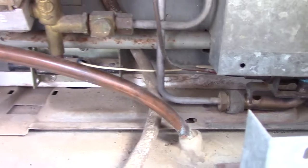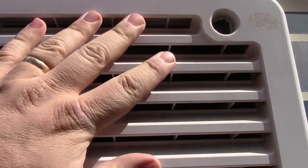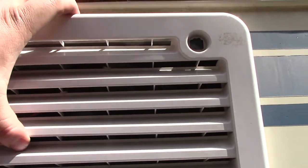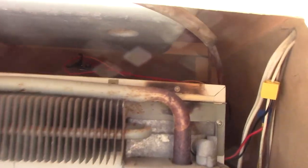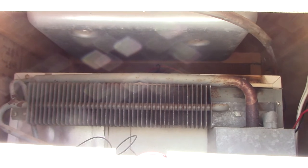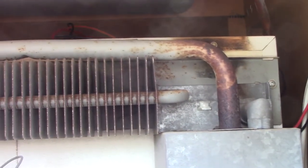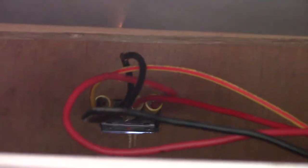You want to make sure that's all nice and clean — keep it clean in there and put the fans on it. I think the fans make a huge difference because it gets very hot up in here, and the fans help bring that heat out — you can feel it coming out of the top right now. Definitely put fans on it. You can even put them on a thermostat and mount it up where it's really warm so it'll kick on automatically when it gets hot — that would be ideal. For right now I'm just using the switch on the front of the fridge. You also want to keep those coils clean — blow them out, try not to hit them too much, but make sure all the dust is off them. There's where I mounted the switch to the inside of the trailer — I just ran the wires and found a negative and positive to tap into.